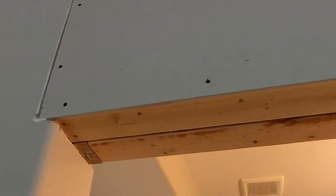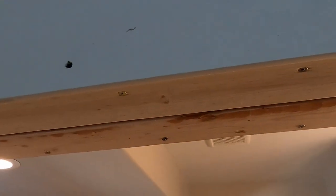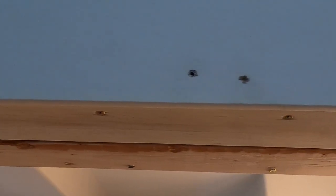I'll cut that piece out. I did get the first piece of drywall up. You can see I have a little extra hole there — I went a little bit too far into the drywall, so I had to put another screw just right next to it. For this next piece, it's going to be 42 by 15. On this side, I spaced the screws every 8 to 10 inches.